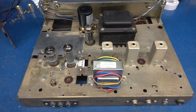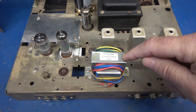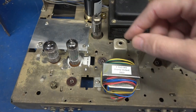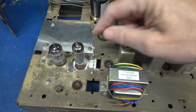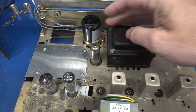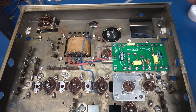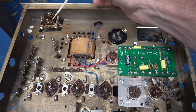Here's an update — I have the layout complete. We're going to be running one of the CHAMP output transformers, sold by Amplified Parts. Really nice little transformer with 4 and 8 ohm outputs. 6AQ5 output tube, 12AX7 preamp. We're going to maintain the 6X4, and I landed a new filter cap.